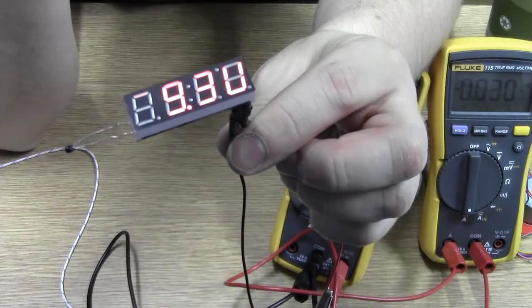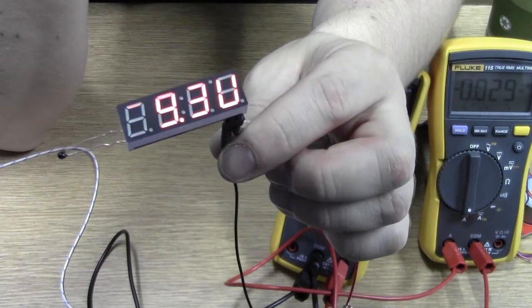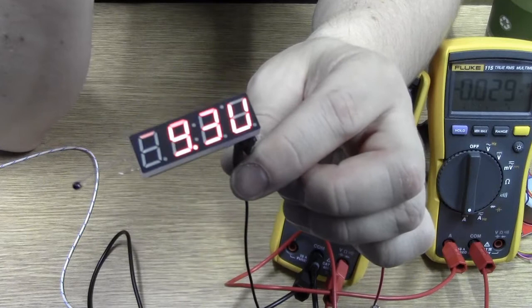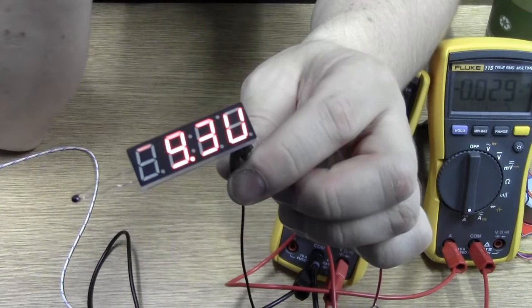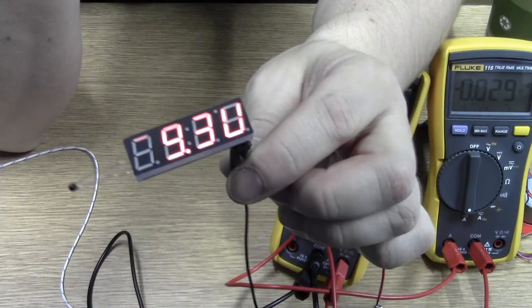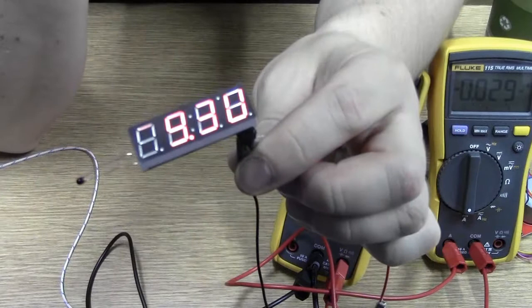And the electrical characteristics, it doesn't really match up to too much, except for the input voltage range and the top end of the input current. That's the only thing that really matches. Voltage resolution, 2.9 millivolts. It was kind of sticking to that. It was close, but difficult to tell, seeing that this doesn't actually measure in the tens of millivolts. It reads in hundreds of millivolts. But following it on the meter, it was switching over every so often around that value. So on and off.